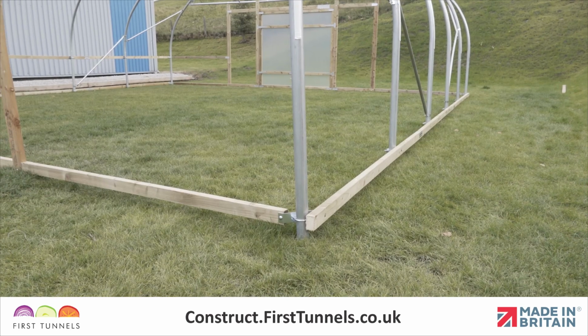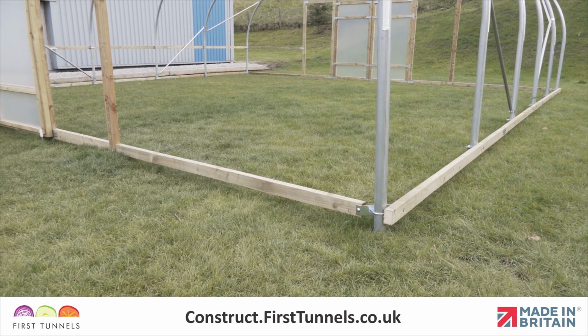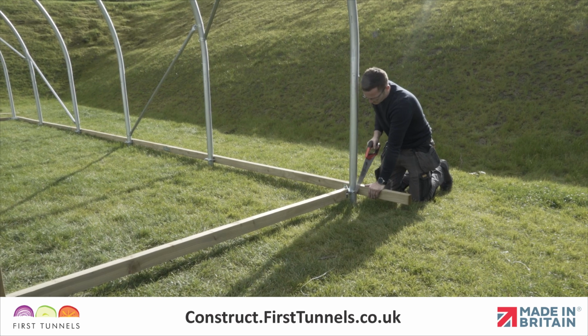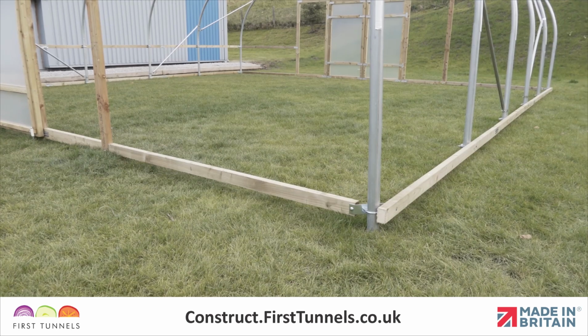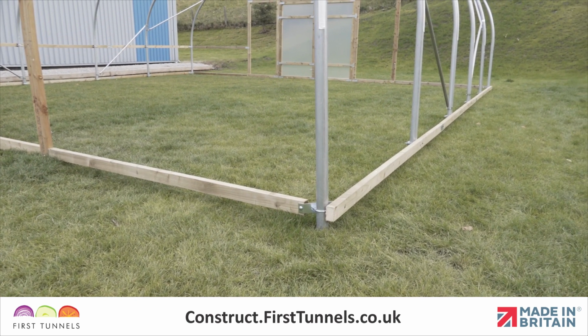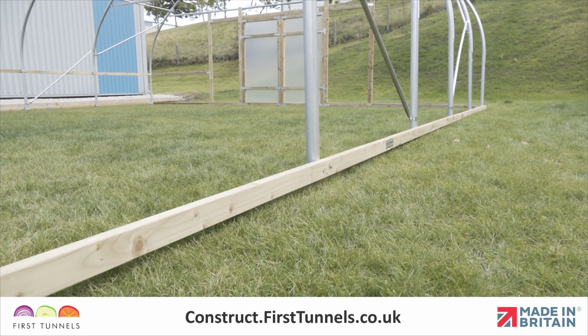Fit the base rail from the doorpost to the corner on the opposite end of the polytunnel using the same method. Cut the excess base rail down the length, flush with the end of the polytunnel. We can now fit the base rail on the opposite side. If your ground is not on a slope, then repeat the procedure you followed for the first half.